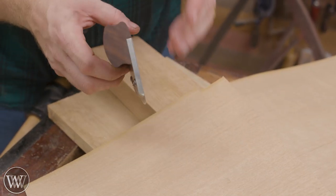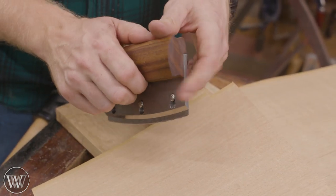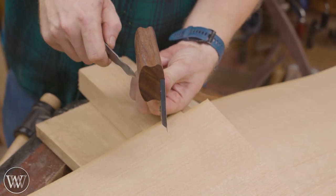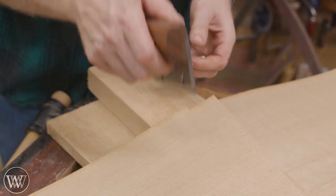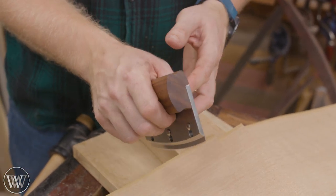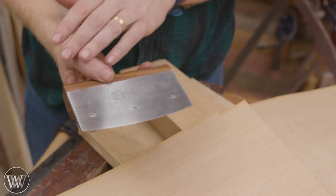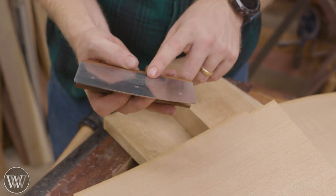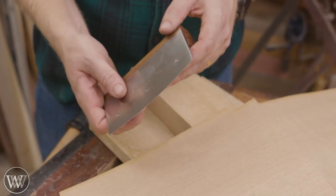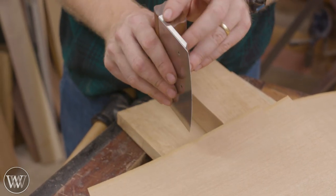Now, you're going to see on Amazon quite a few other veneer saws where they'll have a cutting tooth on both sides and a handle that comes out at a weird angle. Those are really uncomfortable to use because your hand is not in line with it — you're putting pressure out to the side rather than on top of it. This design is really useful because it's all right there and you can slice very quickly and very easily. I'm not sponsored at all by Gramercy Tools or Tools for Working Wood — I just purchased this one. I'm thinking about getting the King Kong blade to have a little bit of fun with that as well.